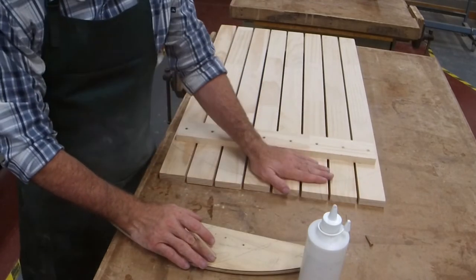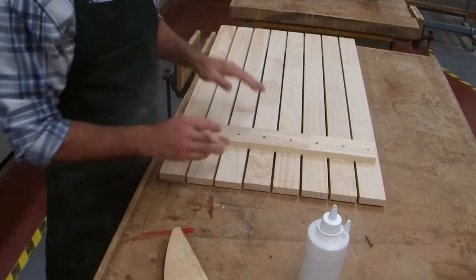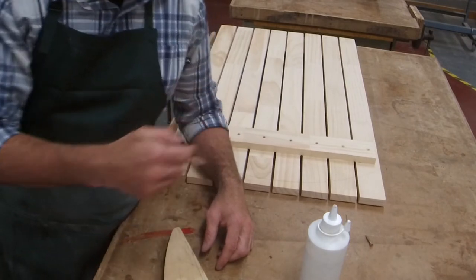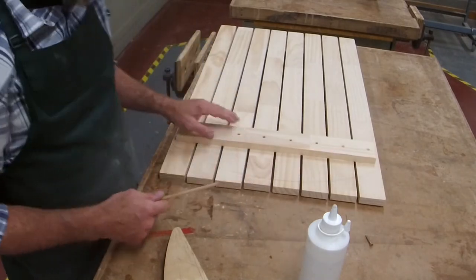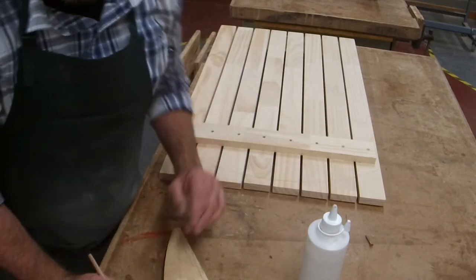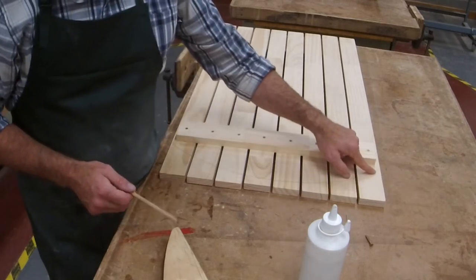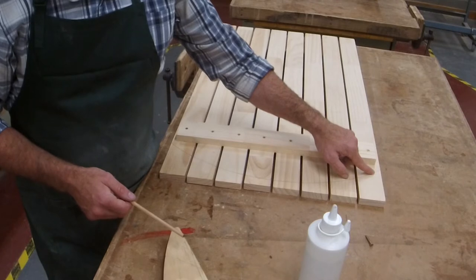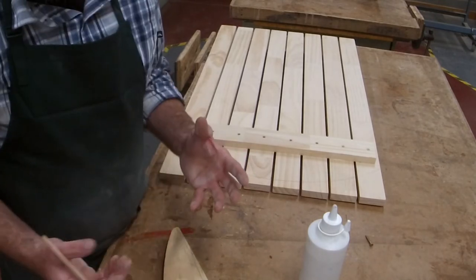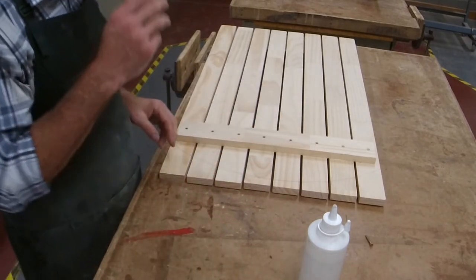Perfect. You have to do this bit first, because after we put the brace on for the armrest, I lose a flat working area that I can successfully bandsaw the top. Bandsaw, jigsaw, it won't matter. I'll use our bandsaw. And then we've got a nice belt sander in there, and I'll use that to do the top. Depending what sanders you got, go for it. Again, whenever we sand anything, when you're finished, if your hands like it, it means you've done well. All right, let's go.